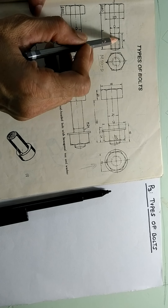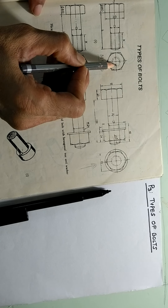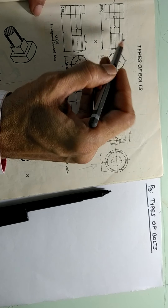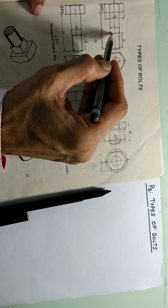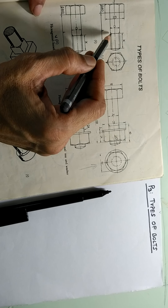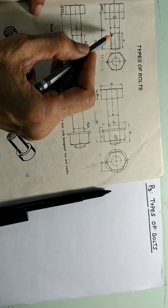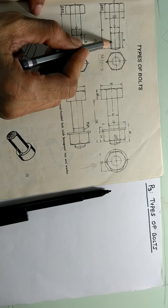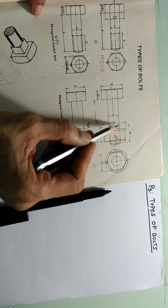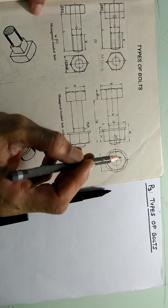The outside size is shown by a dark line, the inside groove line is shown by a medium line, and this medium line becomes tapered after distance X. This shows that threading is available till the distance X. After this distance X, threading is still there but it is a tapered threading — it is not functional, it is of no use. So that is shown by this tapered sign. All these conventions are extremely important; we have to draw the threading as per this convention.